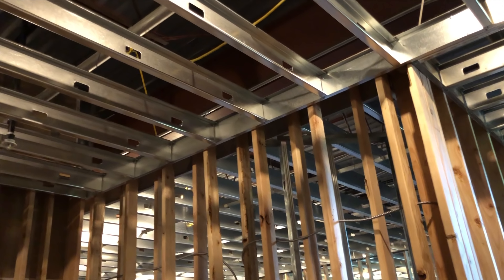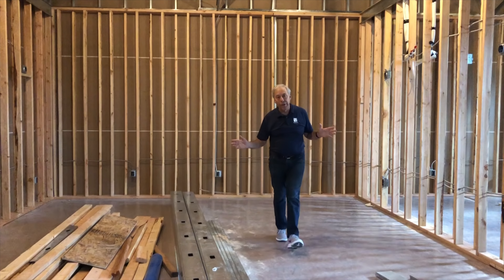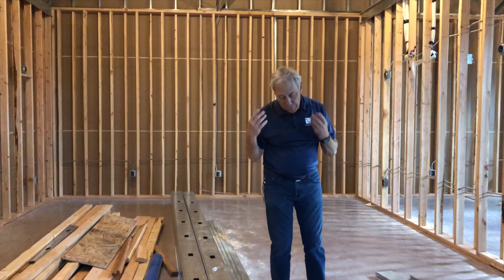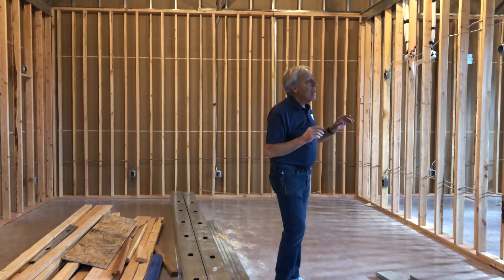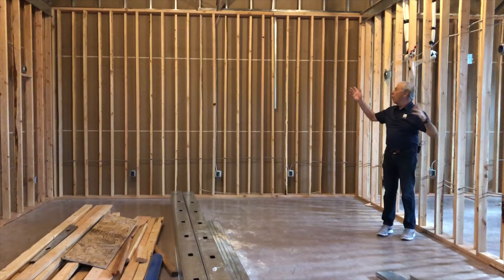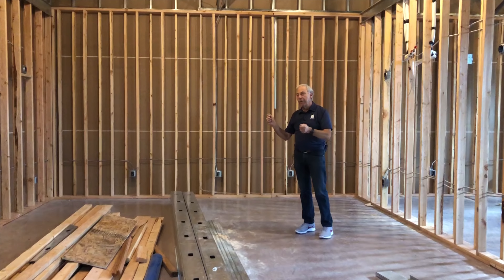So you'll have the 45-degree angles, then the straight across roof. One of the tricks we're doing in this room that's really easy to do in any room — and if you don't know this trick you need to learn it, because it's easy — if you're any good with a saw, you can do it. And that is to use crown molding at the 45-degree point where the wall meets the ceiling. And it's that same 45-degree angle we're putting along the wall. It looks cool when you walk in, you wouldn't know, but it gets rid of the slap echo.